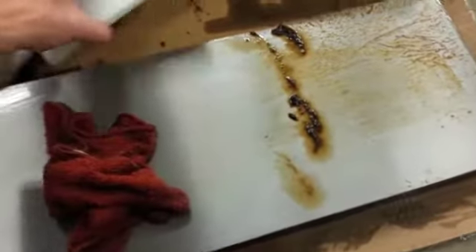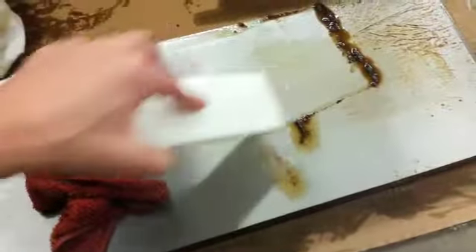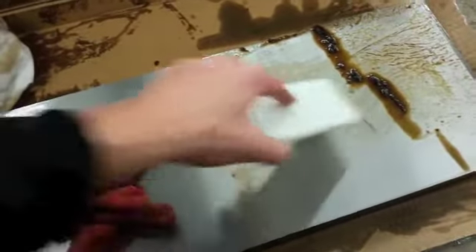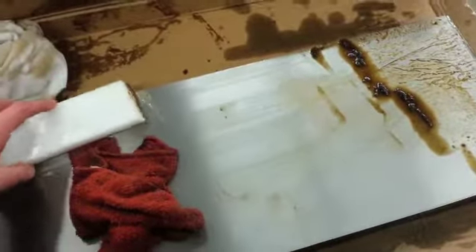I'm letting this soak, and I made this little plastic scraper since I didn't have anything. It tends to push the Cosmoline right off, and then there's just a real thin film behind. It doesn't take too long — I'll probably have about a half hour in cleaning the Cosmoline off, and then I'm getting ready to assemble it.